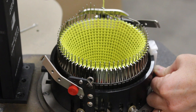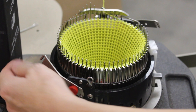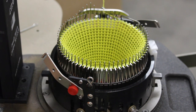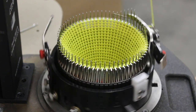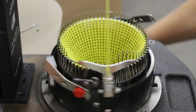The cam shell must now be rotated in the opposite direction. In this case, the cam shell must be operated in the counter-clockwise direction. To engage the cam shell, lock both cam shell keys in place. It might be necessary to rotate the hand crank so that the cam shell key can find the opening in the drive gear. Be sure to rotate the hand crank in the opposite direction you were rotating it when you were in the cylinder mode of operation.